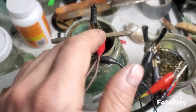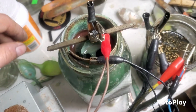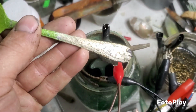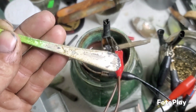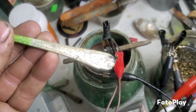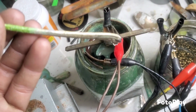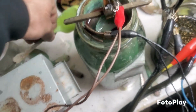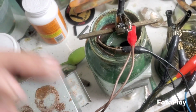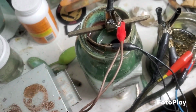As you do this, if you do it really fast, with the 12-volt process, then you get a bit of a problem. You'll see the pitting on this spoon where it's brass, and you get a lot of that. You get a lot of metal in your electrolyte that you don't really want, which is copper or tin or zinc or whatever's in the brass, or if it's nickel. So to minimize the weight of non-value-added metals in your solution, you can go with a lower voltage, but it takes a lot longer.